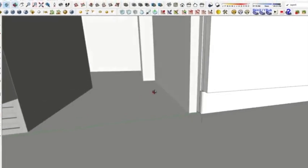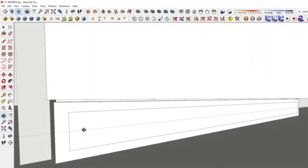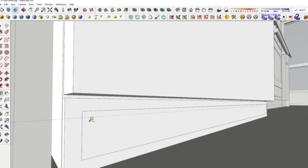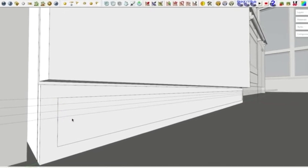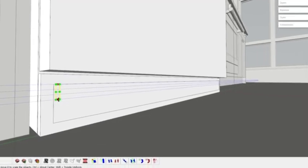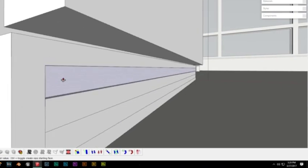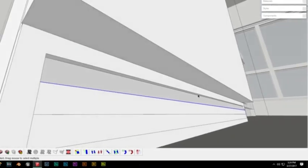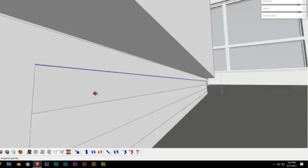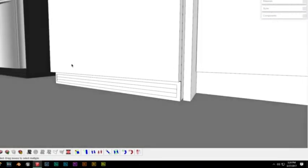And so now we have the front piece here, and we can try and emulate a similar style over on the bottom of this fridge, except I think we'll change it just a little bit. So we have this offset 1/2 of an inch, and I think what we'll do is say 0.25, and we'll do that same scaling that we've done in the past, and just take these 4 lines here and scale them down to the bottom, and that'll give us 3 equal segments. Then we can just bring our lines across here like this, delete our guides. Now if we push these in, say 0.25, and then just drag the bottom line out again, it'll give us a taper, and maybe not 1/4, maybe we'll just push it in a 1/16 and bring the bottom back out. Alright, and that gives us a vent that we can use for the bottom there.